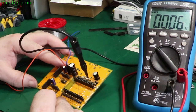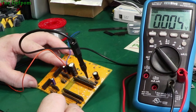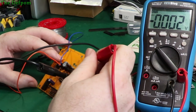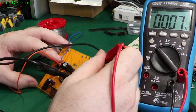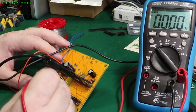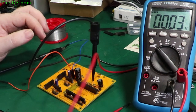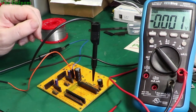Let's just make sure there's nothing 5 volts where it shouldn't be — you get 5 volts going to an ESP32 and you'll destroy it. I think the VIN should be the one which has it and nothing else. That's all as it should be. I'm happy with that. So the 5 volt power supply looks like it's going to be alright — at least the rail configuration is correct.